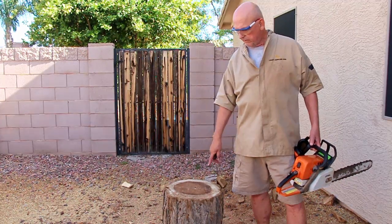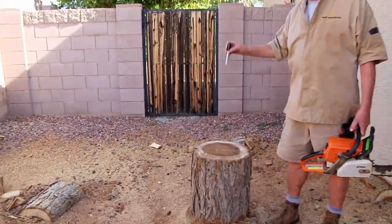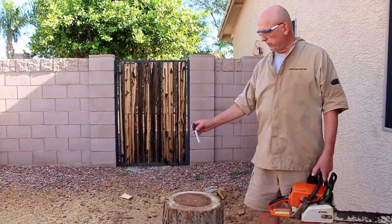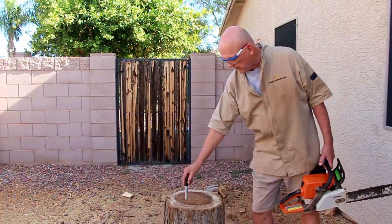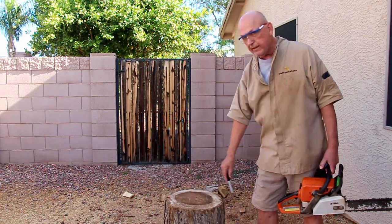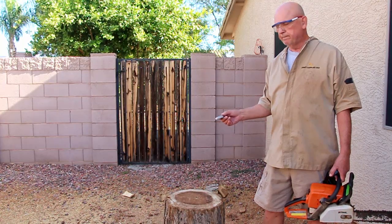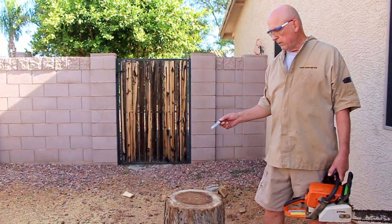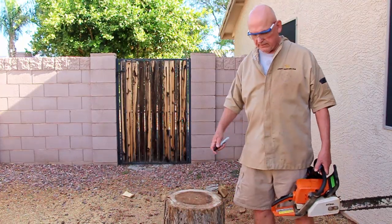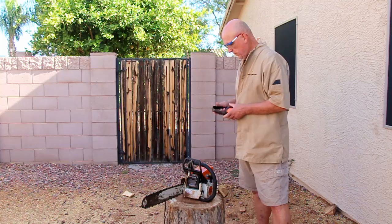I've marked the bottom too. The pith will pretty much go straight down, but on some logs where the trunk is tilted, the pith will be over on one side, then on the other when you turn it around. Depending on how you cut it, you're either going to get one big bowl or two smaller ones when you have to deal with the pith. It'll probably make more sense once we cut it.